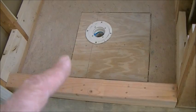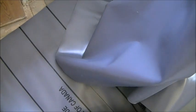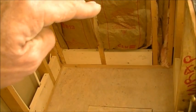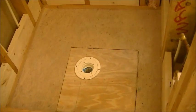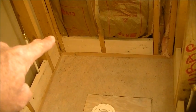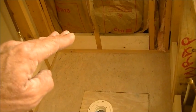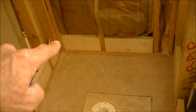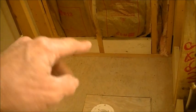This pan liner is a four-by-five piece that Home Depot sells pre-cut. I have basically a three-by-three shower, so you're going to see a whole lot of excess pan liner going up the wall about this high — a lot of pan liner for a small shower. At the very minimum, with a two-by-six and two-by-four at the bottom, you have about six inches of room, so going up about seven inches is good.